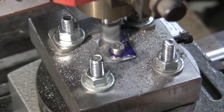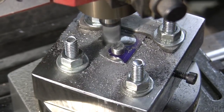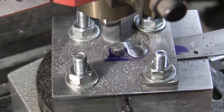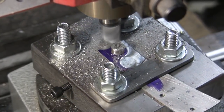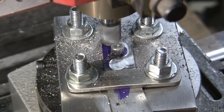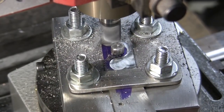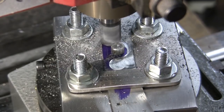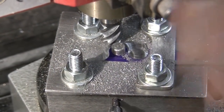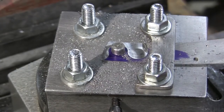On the final pass, I'll bring it all the way to the line and then roll it back to the corner. I switch to my Optivisors to get down in there and really see that corner. I think that'll do it right there. I check my corner, disengage, get it cleaned up, and take it out. Off camera, I vacuumed up all the little chips.